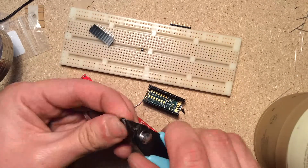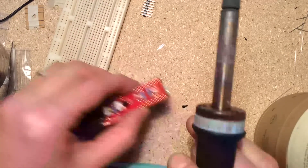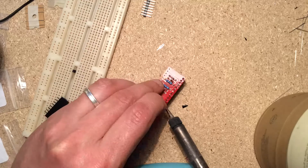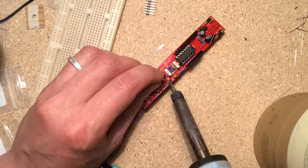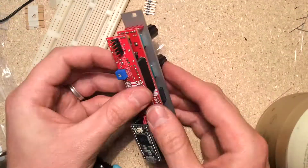After doing that, I again snapped the loose female headers on the males before fitting them to the circuit PCB and soldering them in place. That's it — now just snap everything together, check for shorts in the power rails with a meter, stick in an SD card and fire it up. Mine worked perfectly on power-up and I made a patch to test it with the factory chords first.